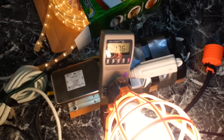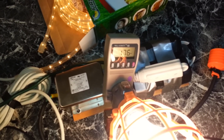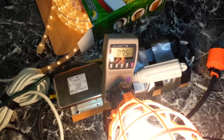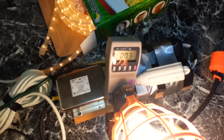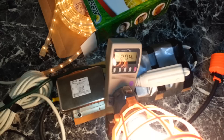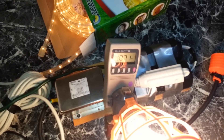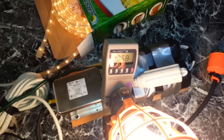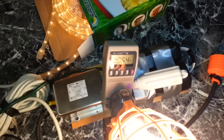This is the electric heater on low — you can probably listen to the engine as it loads up. We're at about 800 watts with the heater on low. On medium, pulling about 1,072 watts. The engine's loading up pretty good — no skipping or anything like that.